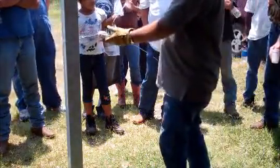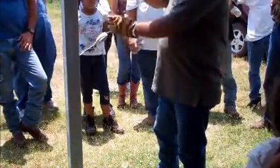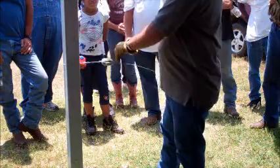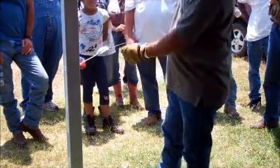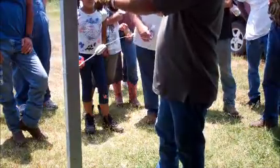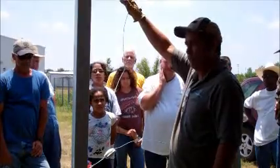The reason I want this end wire — if you're putting up multi-strand wires, you've got to have some way to join them together. Leave your tail on here always, because if you're putting up three or four or five strands, you can come here and attach that to your next wire up and just keep joining. You can put your jumper right there, put another jumper right up here and go up about four wires high with that strand.